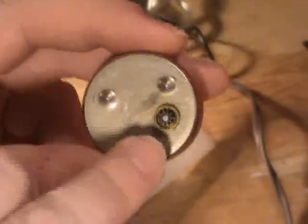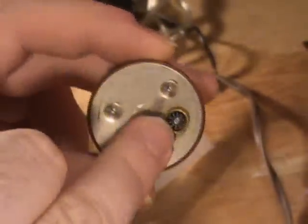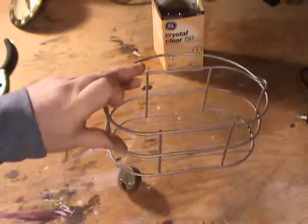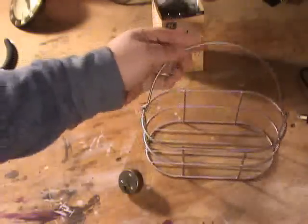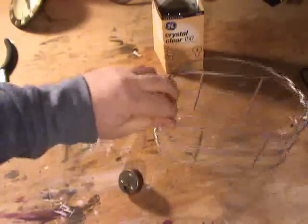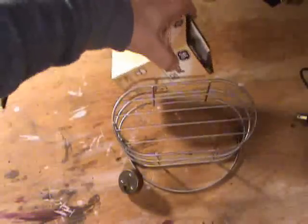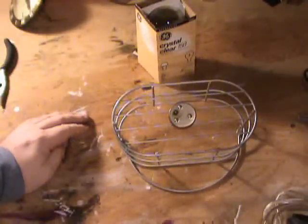What we need to do is unseize the oil. We're going to do that by using heat to melt the oil and pour new oil in through the little port that sits underneath the gear in that little cup. I found a little gift basket upside down to use as a cage — we're going to put the light bulb inside, wire it up, and our rotor will sit on top to be heated nice and evenly.